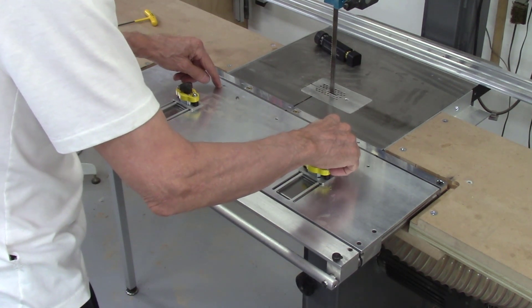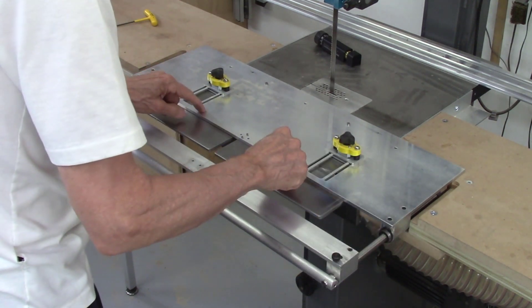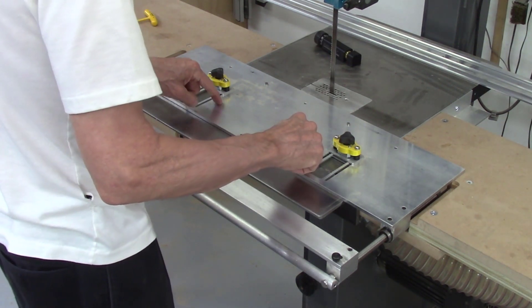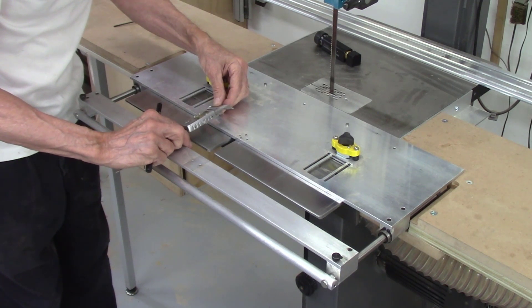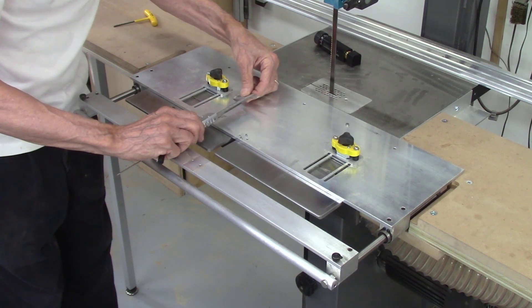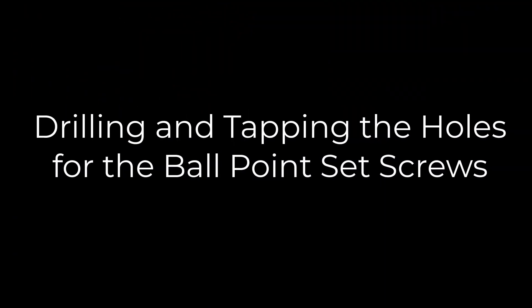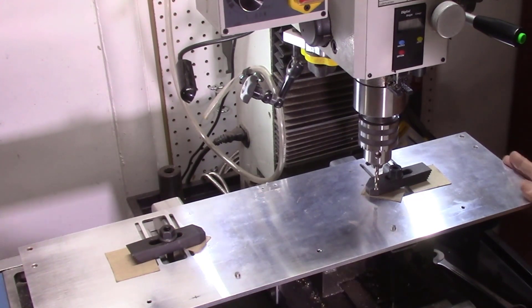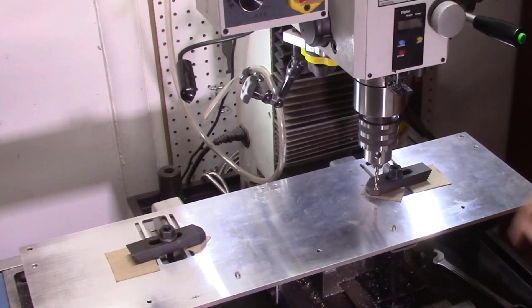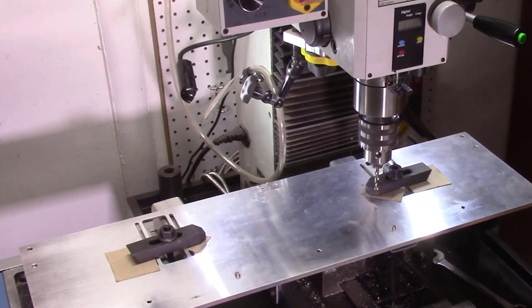As you can see, when I drill these holes they're going to go across this miter bar. Some stay on the table and some are on the outside plate. I think I'm going to actually drill eight holes total — at one inch, four inches, and two and a half inches spacing. I had to jury-rig my system to mount on my table, because the AccuSlice table is actually much bigger than my mill table. I also take the magnets off in order to clamp it, clamping through the magnet holes. I'll be drilling and tapping these six holes and the outer holes, which I'll have to turn the plate 180 degrees to do.